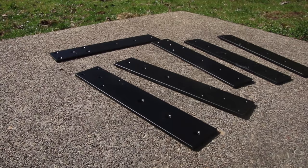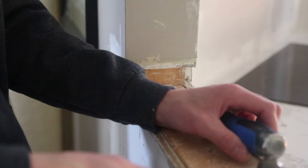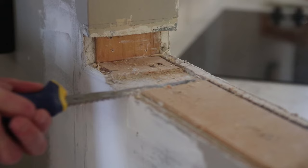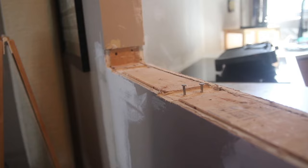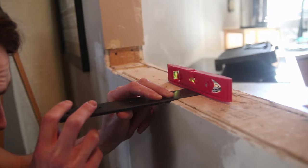Now things get really fun. I had to chisel out the top of the wall so these bars could countersink down into them. I used the chisel to take a little bit of material out at a time, then checked with the bar, and kept doing this until the bar sat in there perfectly. In a couple of places there were nails, so I pried them up, used the chisel to go under them, and then drove them back in at the end. Make sure you're checking your level through this whole process so everything is even — it wasn't as bad as I thought, but this was a more complicated part of the project.